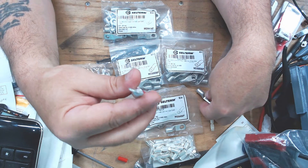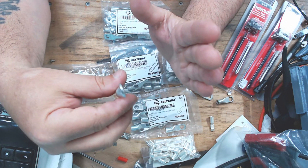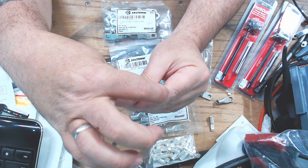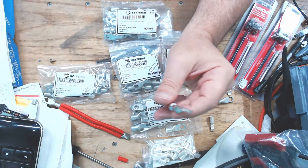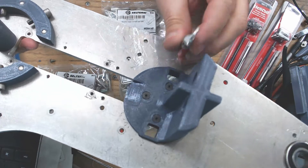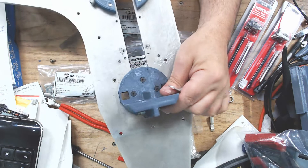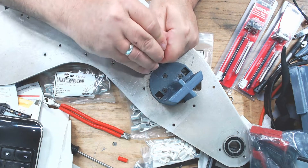For the batteries I'll use a quarter-inch hole number four lug, and I believe I'll use the five-sixteenths lugs where it bolts to the track drive side plate. Let me grab the side plate and see how well the lug bends around it.